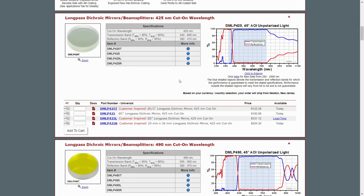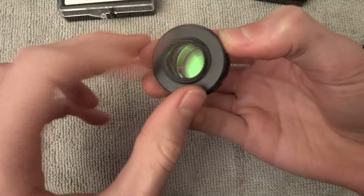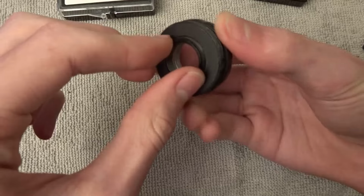In any case, I have 2 FR mirrors and 2 OCs, one that lets 40% of the light through and one that lets 80% of the light through. Solid-state lasers like this are very high gain and need very little of the light to be reflected back in order to laze, so this 80% transmission OC is not crazy.